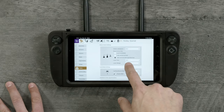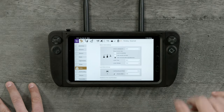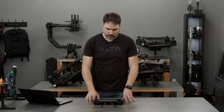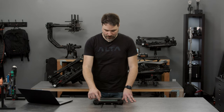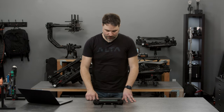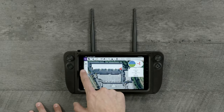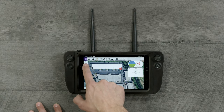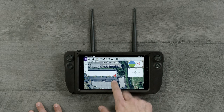The default here is a loiter of 45 seconds above your landing, and then it's going to do that at 10 meters — so right around 30 to 33 feet — and then it will land after that 45 second period. So just make sure this is all set up appropriately and then you're ready to move on to the next step of flying. For that, we'll click on the little airplane symbol here, which will take us to the fly module. You'll see your aircraft on the map. Then we'll go ahead and walk you through arming the aircraft and taking off. Let's head out to the field.